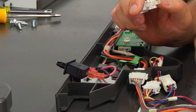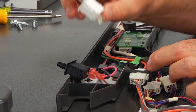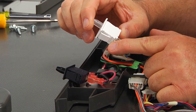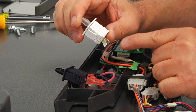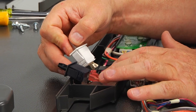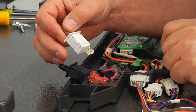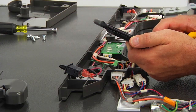So we are just about to take out the wires. But before that, we need to know which wire goes on which terminal. On the new switch, if you turn it over, you will see the markings — this one is common, this is normally closed, and this is normally open. And now we're going to turn it over, and that would be exactly the position of the old switch wire connection. So the one on top is a common, which is brown color. Then we've got normally closed, which is pink, and normally open, which is black. Take a picture of the switch the way the wires are connected so you will have a color guide.